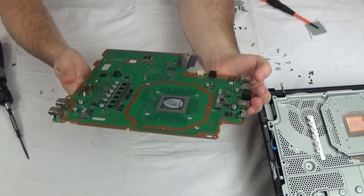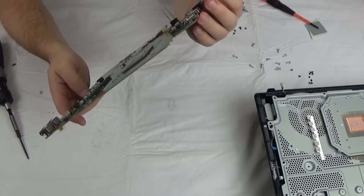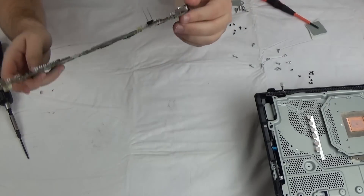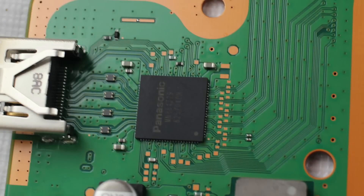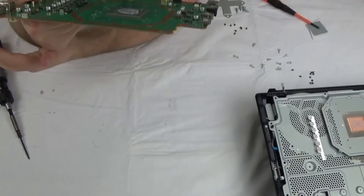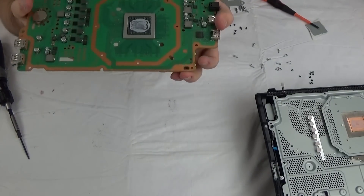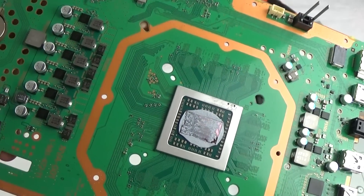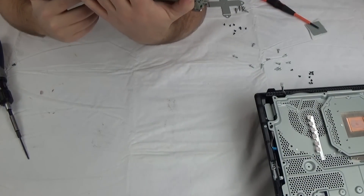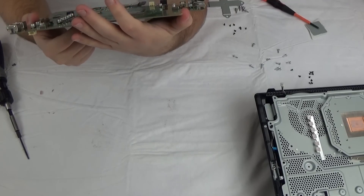What appears to be our south bridge here on this side of the APU — this would manage things like your hard drive. When the SATA comes in, it converts and moves there. We also have our WLAN or network card there, and you can tell right away because all the antennas run right off of it. This is actually a pretty compact board — I'm actually shocked for what it does. USB is there. Here's HDMI — and here's our HDMI scaler chip responsible for images going out, whether to talk to the TV or scale images in general. They were very heavy-handed with their compound — it actually spews out from the sides of the die. Not a bad setup.